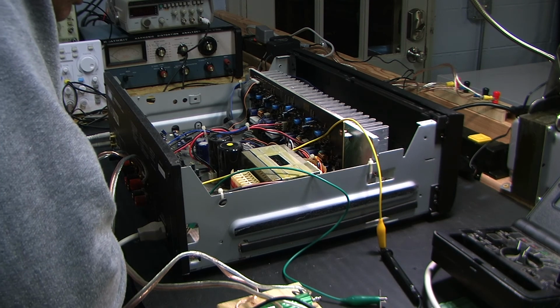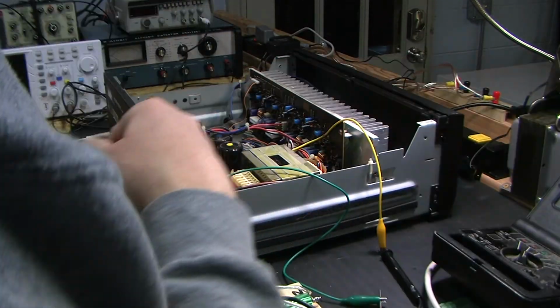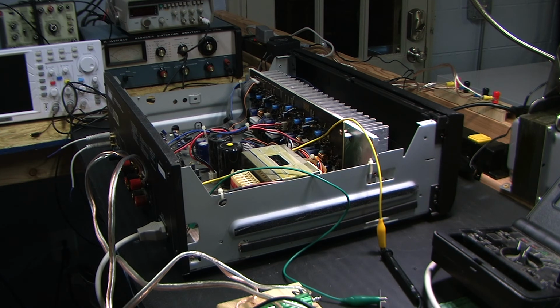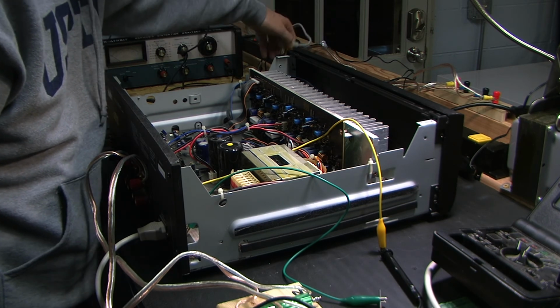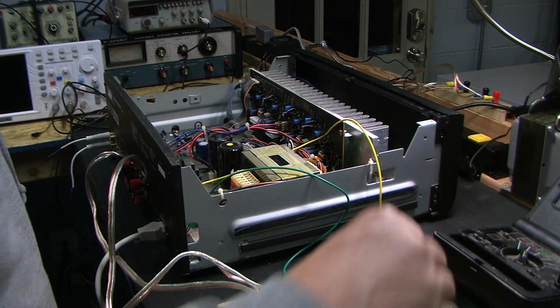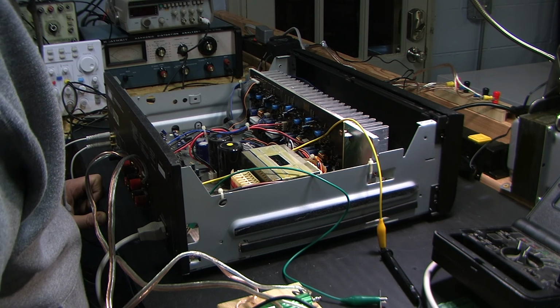Alright, turn this thing off. Switch off. And I like to unplug. I'll leave the isolation transformer plugged in because I'll be needing it. Now I'm unplugging. I always like to unplug the isolation transformer. There's no better isolation than that. Okay, so that's good. It actually turned on, and again, that's the first thing: the smells, noises.